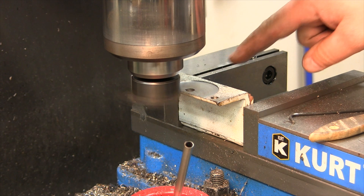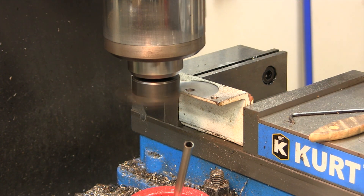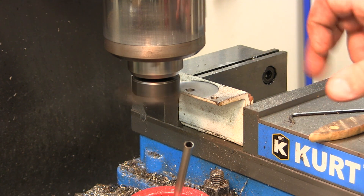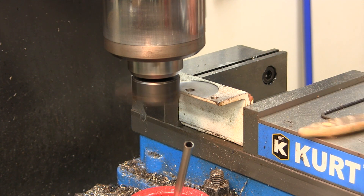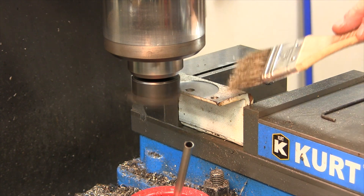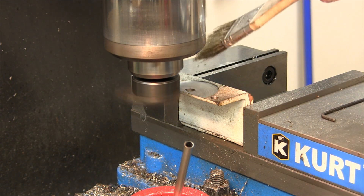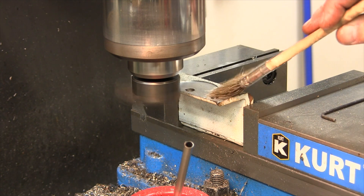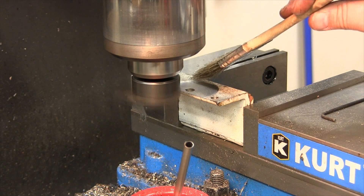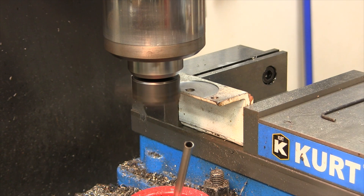What I did here is I don't have any means of cutting a big two-inch circle, and I really didn't feel like going through the steps of boring it and everything. So I hooked up a fly cutter — I measured the distance, drilled the hole here and here. These are going to be the spanner holes. First I drilled the center hole, then went off of that to get the two-and-a-half-inch span. Drilled and reamed it to a quarter of an inch, and now I'm just fly cutting — just down, down, the easy way.